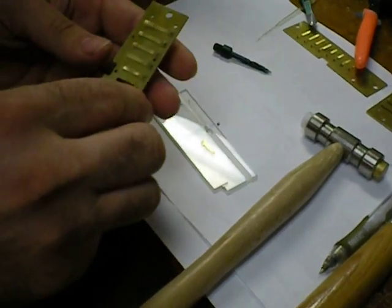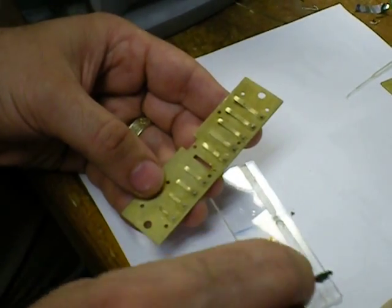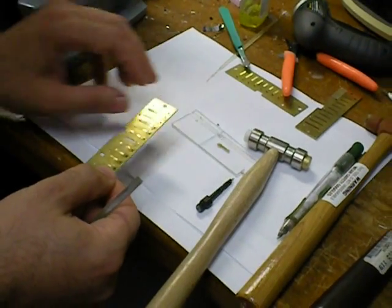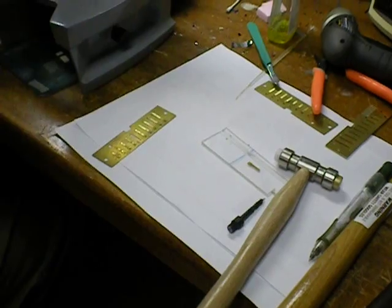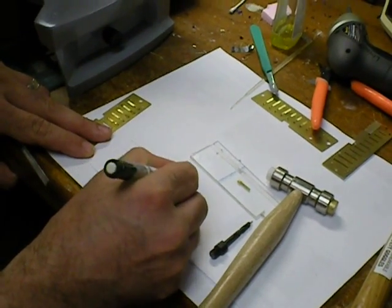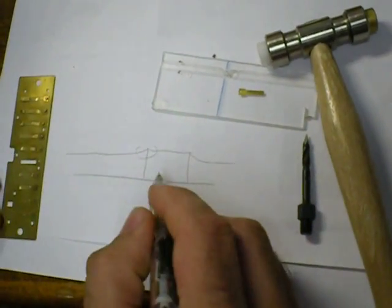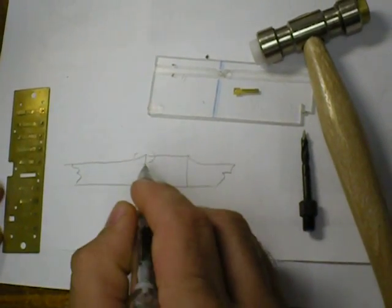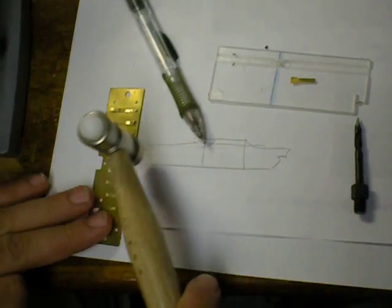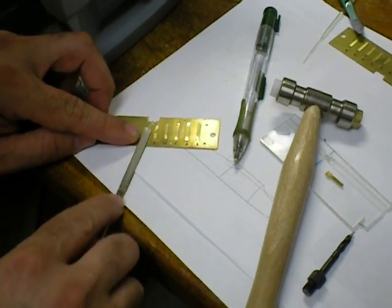There's the reed. You might notice that in the process you might create a little raised area on top of the area where you removed the reed. It's important to flatten that before you attach a new reed because it will kind of get in the way. Just to be absolutely clear what I mean, I'll draw a quick picture. So this little bulge may have been created in the process of punching out that reed.